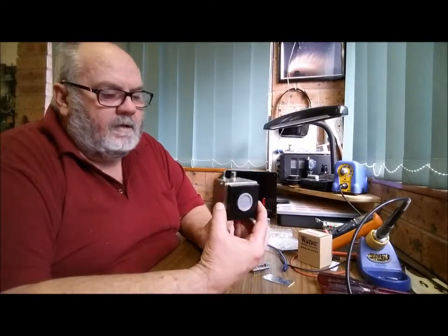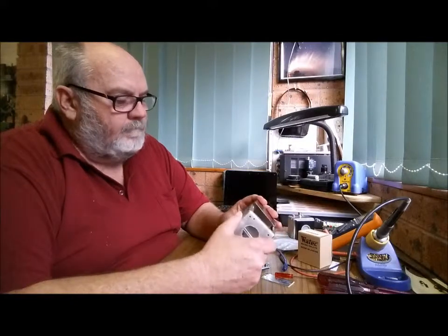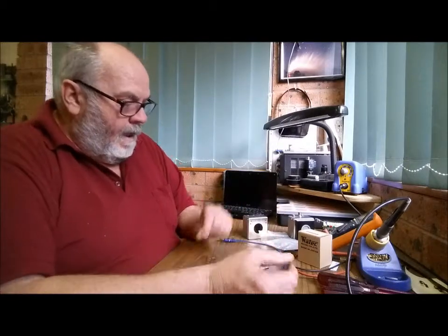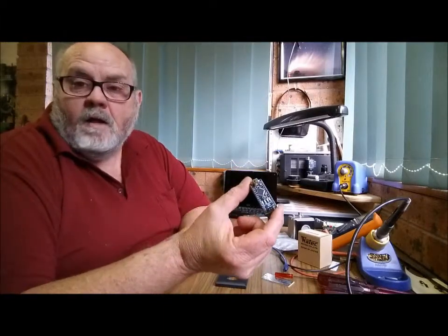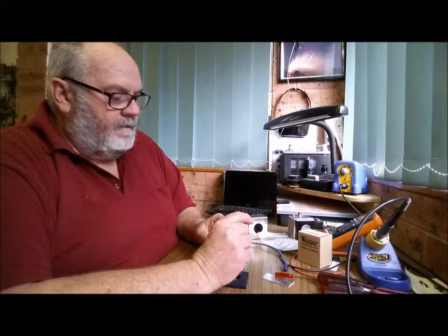I'm the metalworks and machining guy, so I designed the stainless steel housing, which is laser cut, folded, and welded. I also make the various components — here's a Delrin cap that I've drilled and machined, and a camera mount plate which has been laser cut from four millimeter aluminum and drilled and machined. The system is controlled by an Arduino Nano microcontroller, and into this is loaded the TACOS BD firmware, which was written by Tony.